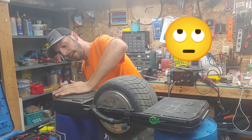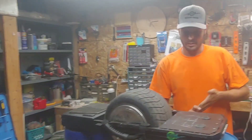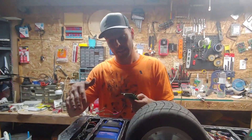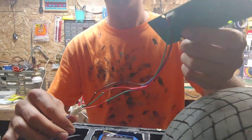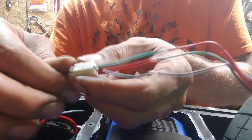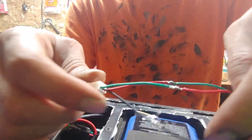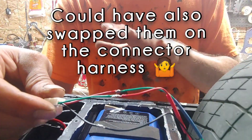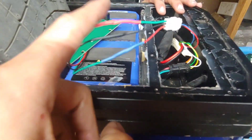We're not getting any activation back here. We found the problem with why this board wasn't activating. After checking multiple sensors and checking continuity, we discovered that the wires were hooked up incorrectly for their inputs to the controller. We basically had to swap the green and the red, and now it works correctly — but these were hooked up incorrectly.